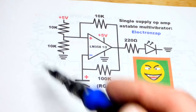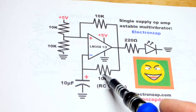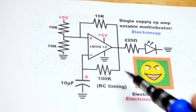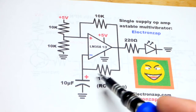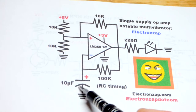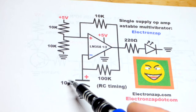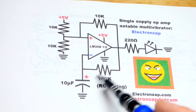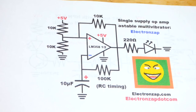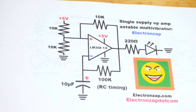These component values work out well. I'm using 10 kilohms for all resistors except the timing resistor, and a 10 microfarad capacitor. If you want a slower flash, use a higher resistance or capacitance; for faster, use lower values. You can balance them for the timing you want. That's about it for this circuit — let's look at it on the board.